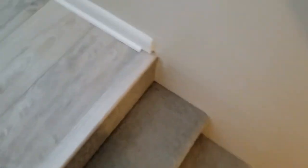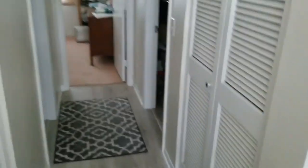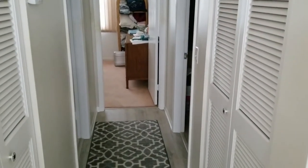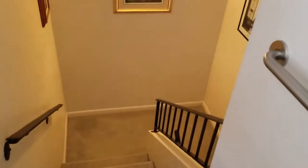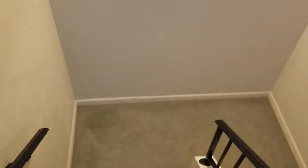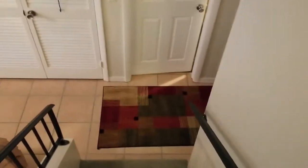The stairlift will stop right about here on the second landing, and then our customer will be able to walk the length of this hallway with an assistive device, most likely a walker. This is going to be a very special and custom job because we are actually going to have something different. We're going to have a stop station right here. So he will be able to park his chair and chassis right there, and it will be able to charge along with the bottom half of the rail. And also with the top, there will also be charging stations. So let's go ahead and get ready.